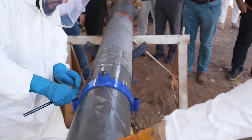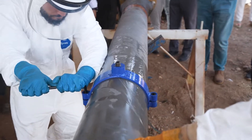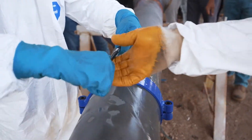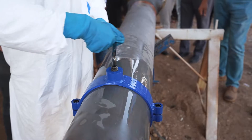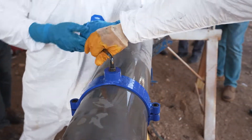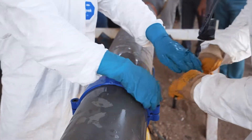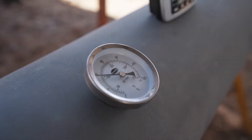It has a pressure rating of up to 200 bar with the maximum application pressure of 150 bar. The spitzer may be applied to live piping systems without shutting down for the repair on hole sizes up to 25 millimeters, and the spitzer clamp may be applied to piping sizes up to 56 inches.